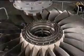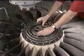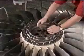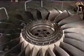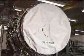The sling is removed and the fan is secured in the storage stand using the clamp plate and the wing nut. That completes the removal of the fan, Module 3.1. If the module is not being refitted immediately, fit the protective cover to the front of the intermediate casing.